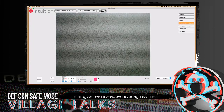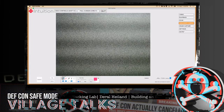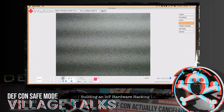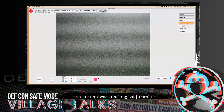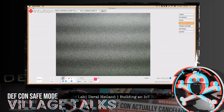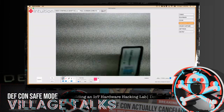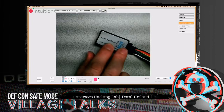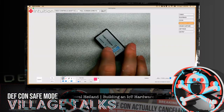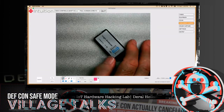One question: is it worth picking up an old benchtop logic analyzer off eBay versus newer USB tools? I don't know enough about benchtop logic analyzers — most of what I've worked with is USB-based. If you're looking for a logic analyzer just to give it a try, I honestly think these $12 24-megahertz ones give you an entry point to get familiar. The Saleae Logic software will actually work on these. I bet nine times out of ten on most standard consumer-grade IoT this is going to be fine. I've only run into issues when dealing with commercial-level devices where a low megahertz rating wouldn't have worked. Jonathan is going to talk about this in more detail tomorrow — definitely swing by his presentation.